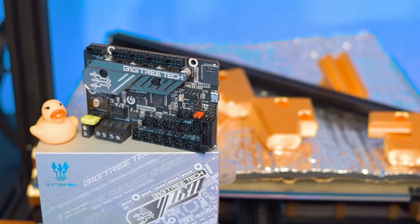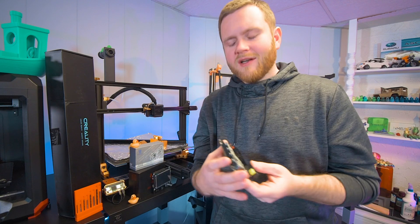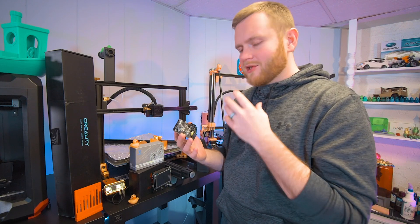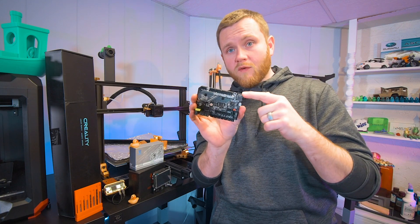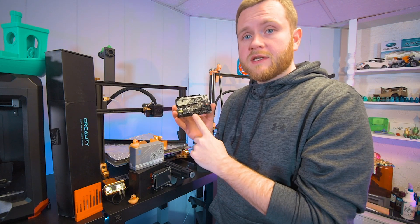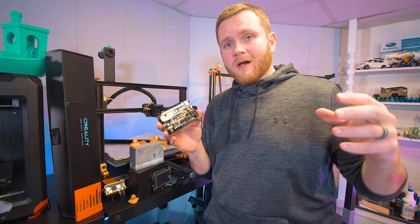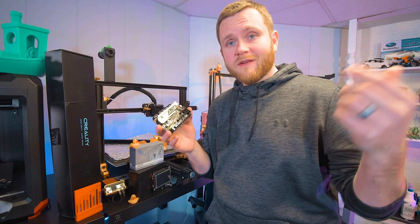I love the heat sink idea. I love that this is moving into more of the PC space where it looks like an actual motherboard. I want the wiring not to be a giant mess — I want it to just look really nice and showcase this thing. This tiny board, even at an affordable price, packs a giant punch with features. The first thing is it has silent fans — broken out one, two, and three. Whenever the machine is on, the fans will not be on. They'll only turn on when you're putting heat through the machine, such as printing, and when it's done printing and cools down, the fans will turn off.